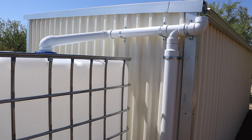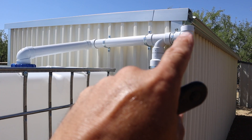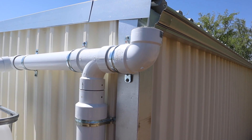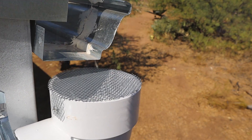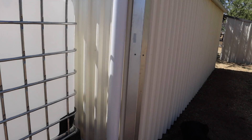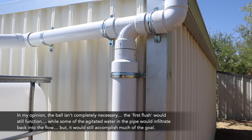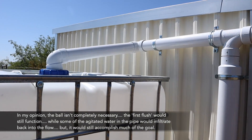This tour is going to be rather quick because this system is rather simple. Pretty much everything this system is comprised of is seen in this shot — essentially it is just a pipe from a gutter to the IBC tote, and along the way the dirty water gets trapped in a first flush pipe. Starting from the gutter, the rainwater flows out into this inlet pipe — you can see I added a screened piece of metal mesh to keep out the larger leaves and other debris. The water then travels down, drops into this teed section, and into a first flush pipe. All of the dirty water gets trapped down there, and there's a little plastic ball that floats up and gets caught in the necked-down section.